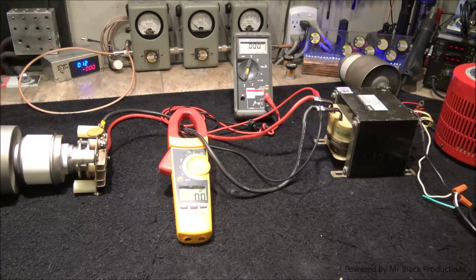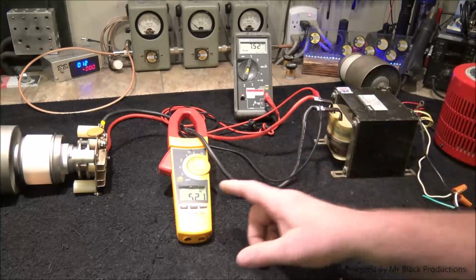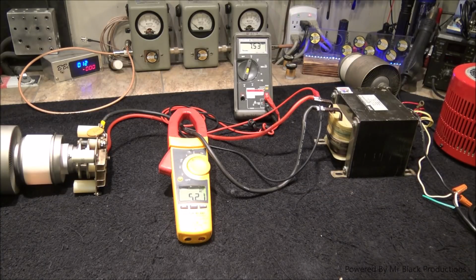Okay, so now I don't know when the last time this tube was turned on, so we're going to bring our volts on slow, and we're going to see our amps immediately jump up. You can see us pulling 25 amps at 1.2, 3, 4. Nice and smooth progression. 4 volts. Let's walk our way on up. Okay, 7.52 volts. We're pulling 52.1 amps, so we're a half amp high from the spec sheet.